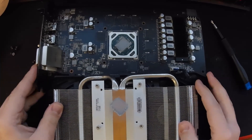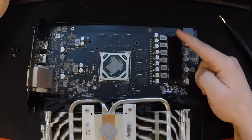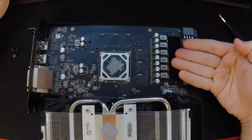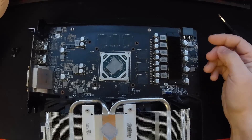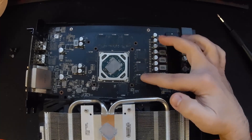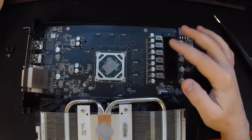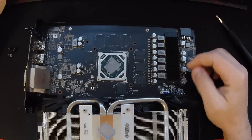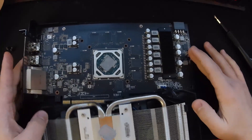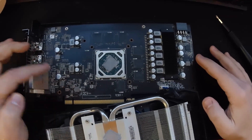As you can see, just the GPU core is touching the heatsink. The rest of the card is cooled by air coming through the fans as a pass-through — so it's just air cooling. This part here is the separate heatsink underneath the VRM, providing the necessary voltage and power to the core. On other cards there is usually a specialized baseplate covering all this and providing extra heat dissipation, but not here — everything is air cooled.